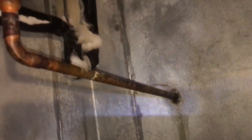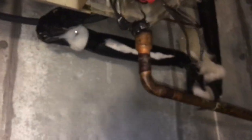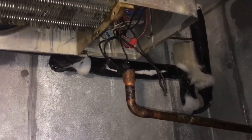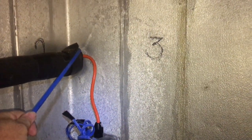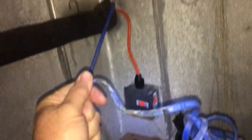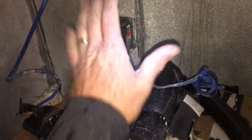This is a really old unit and the wiring is kind of icky. I'm going to ohm out that drain pan heater and check for voltage going to it. The drain line seemed to be clear — it wasn't frozen. I'm thinking the heater was alright; it's still warm. It's just a little 6-watt heater, and it's good.